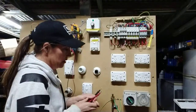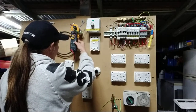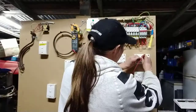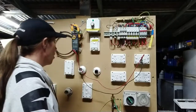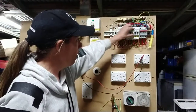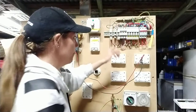Test your tester. Zero it out — making sure you get zero. Helps if you have it on the right setting. I'm going to go active to earth and I should get 10.1. She's climbing down — I've got 10.3. I'm going to switch it off. She's off, so she's switching the active. Now I'm going to check what power circuit I'm on. There we go — I'm on this middle one. I like to know these things; this is the best way of doing it.